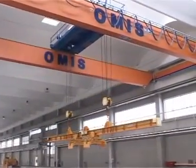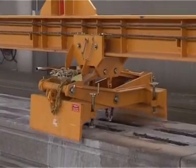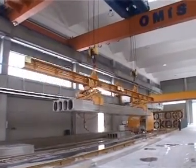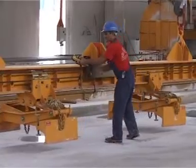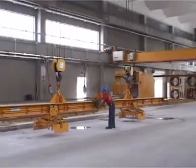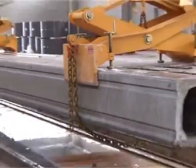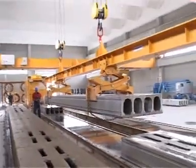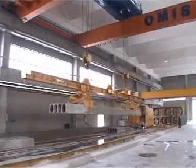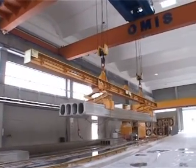Element lifting and stacking: the final part of production is to remove the elements from the bed. This is achieved using an equalizing arm. The lifting clamps can be adjusted along the arm according to the length of the element to be lifted. Safety is uppermost in this phase — safety chains are hooked into position under the elements for protection should an accidental drop occur. The elements are then transferred to the stacking area, waiting to be delivered to the end user at the construction site.